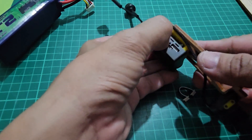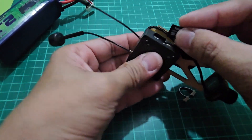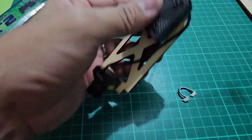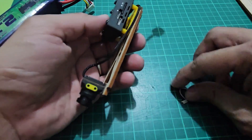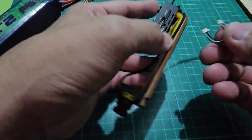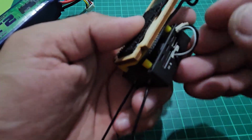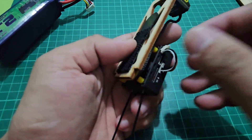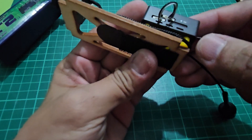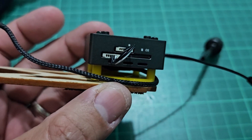Next, we need to put the SD card back to the Moonlight VTX module and plug in the update cable. Make sure that you've plugged the update cable correctly — the white wire should be closest to the port where you see the white dot marking. Then connect the other end to the other port. You can verify that the white wire on the cable is aligned with the white dot marking, which implies that you connected it correctly.